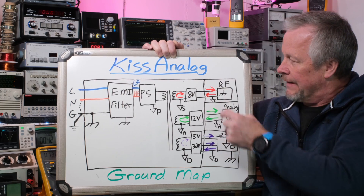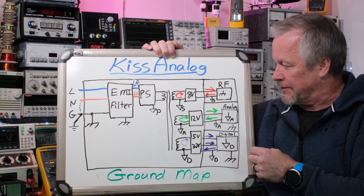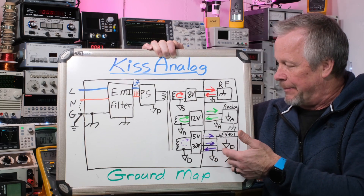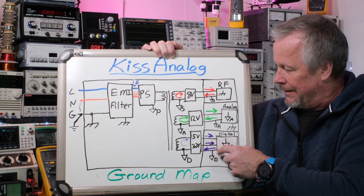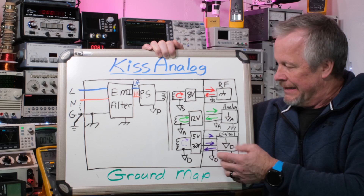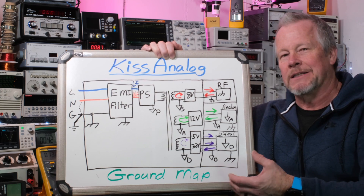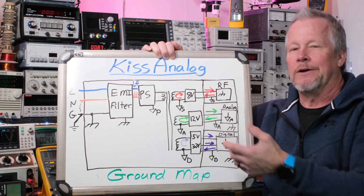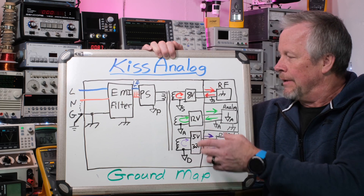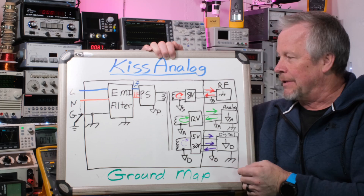Now we have three boxes. The RF is powered with an 8-volt output off the transformer. The analog is powered with a 12-volt output, and the digital by 5 volts — using a DC-DC converter to get 3.3V, maybe a linear regulator depending on power level. They'll have the same return path — still on digital return. I like to get away from saying 'ground' all the time because it's all-encompassing and brings confusion. If we say digital return, analog return, signal return, we know what we're talking about. It's more descriptive, and our symbols show that on our schematics. When we do board layout, the software knows what's connected where.